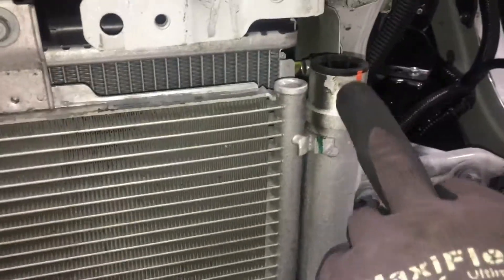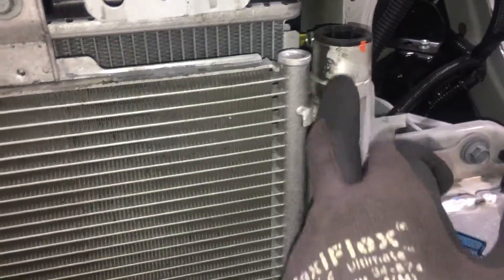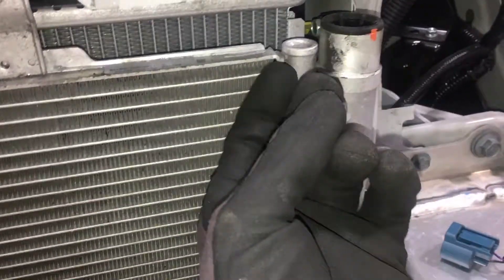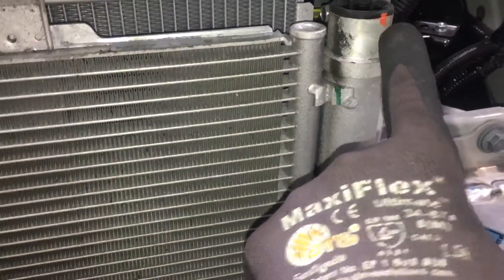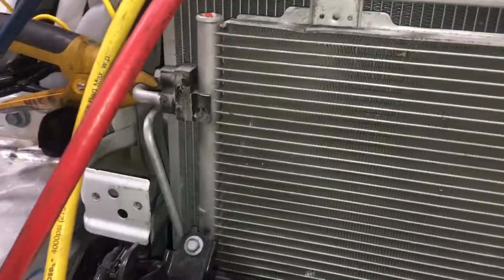What I find is right at the dryer, where the dryer sock goes in — this oil right here. We've got refrigerant oil right at the seam right here, and also a buildup of refrigerant oil right here at the seam on this 2019.